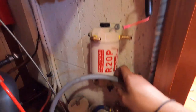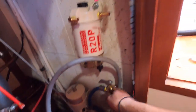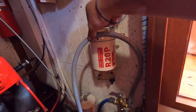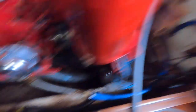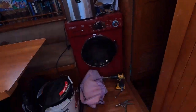All right, goofballs. So this is what I got to work with — the valve. This is again from the tank, so the pump will turn on, you'll turn this over. This will then pump dirty tank fuel — we're not hoping, but expecting — into the filter. It'll filter out, then come out and I'm going to tee it into my return line that runs back to the tank. You can see here those are the through-bolts on the bulkhead; they actually turned out pretty good.